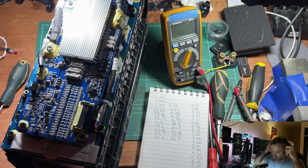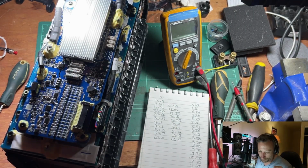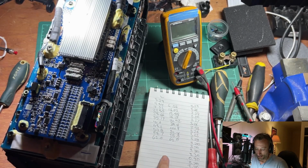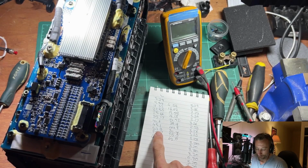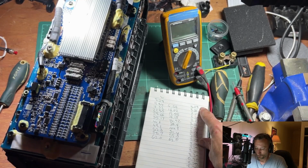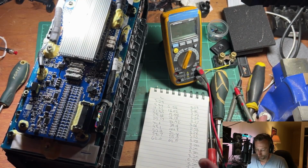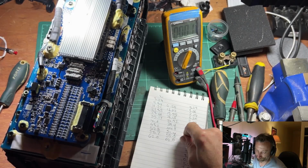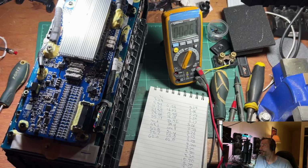We're buggered. All right. Double check, but just looking at what voltage each pack is at, and we're buggered here. 0.9 volts for one of the packs. All these other ones are looking good. 3.3, 3.23, which is fine. Yep. Oh, that's a bummer.